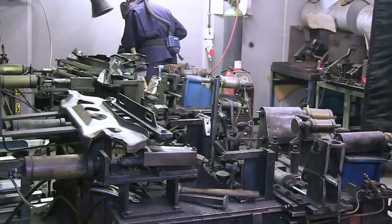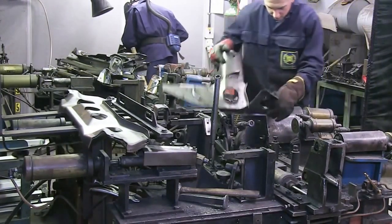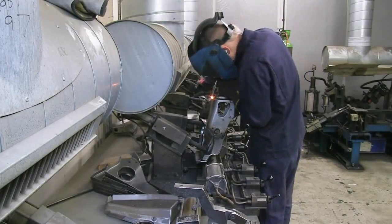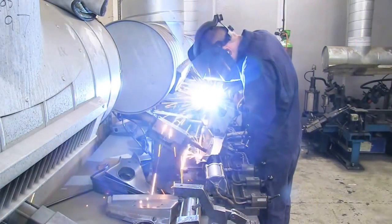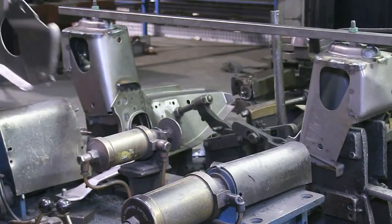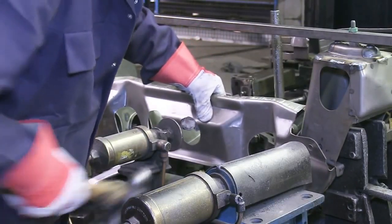The main part of the build takes place on this large jig. Here, previously built subassemblies are held tightly together for welding in exactly their correct positions. These tower assemblies were built on their own special jigs. All these jigs, some simple and some quite complex, with air and hydraulic rams holding the individual pressings in place, are those originally used by Smithsons at Wolverhampton for supply to the Mini production lines at British Leyland's Longbridge factory.